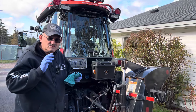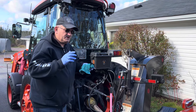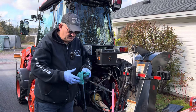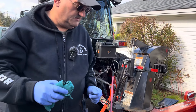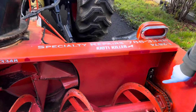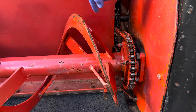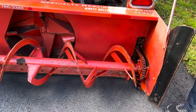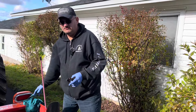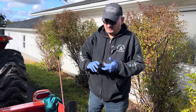The most problems I've ever had with this — and there haven't been a lot — but face it, when are you going to have trouble with a snowblower? When you need the darn thing. So here's the problem: keep this chain well oiled. This sprocket is an idler — that's what keeps the tension on this chain. I'm to the point now where I'm changing them every two years. If it's a real busy winter, for the sake of a few dollars, I'll put a new one on every year.